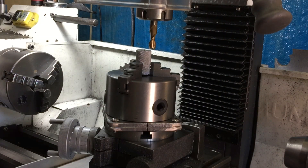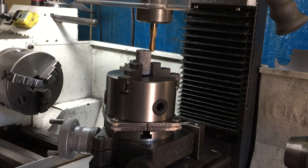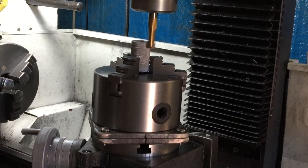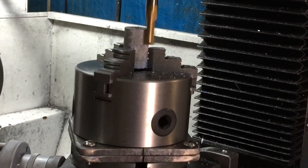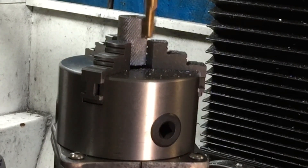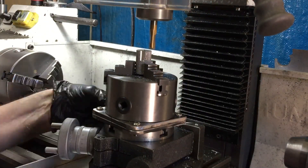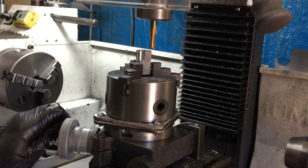To test it out I've just got a piece of scrap and I'm going to put in six little divots on the side. This is a really beautiful process for making thumb screws — it's better than just plain knurling and it looks good too. I'm just using a 10mm end mill, and for six divots I just turn the rotary table 60 degrees at a time.